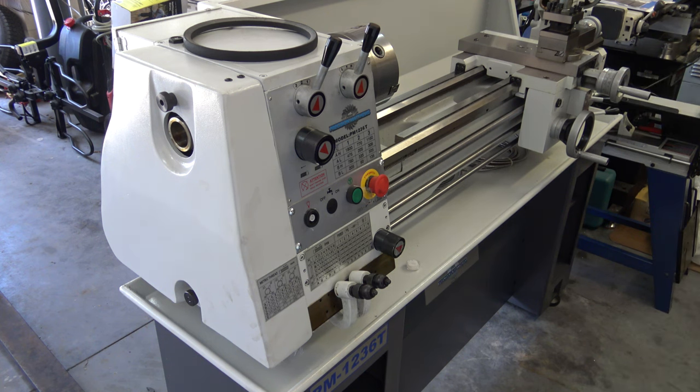It looks like they gave me the wrong hardware for the doors. But rather than call them, I'll just fix it myself. It's an easy fix. I just eyeballed down the edge of the door and put a mark where I need to bend that bracket. So I just duplicated the same thing for the other bracket.